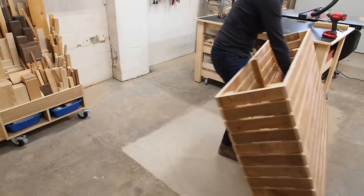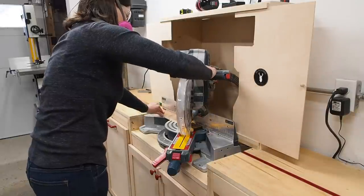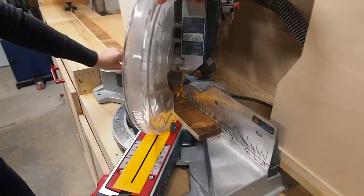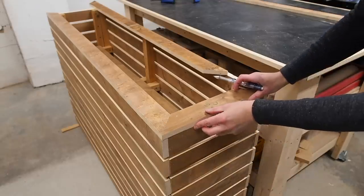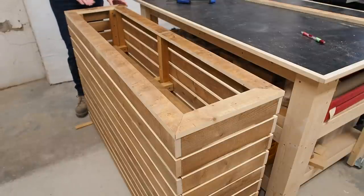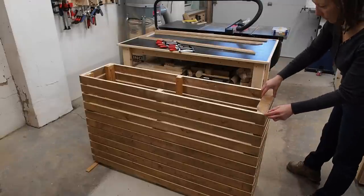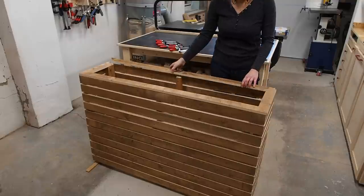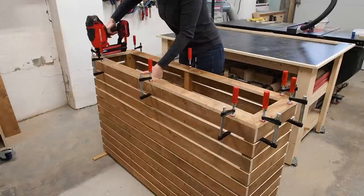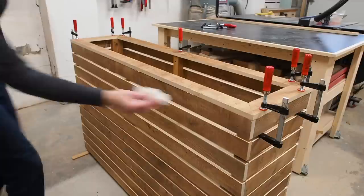Before getting to the secret door, I'm going to trim out the top. I ripped a few more fence boards into slats and I'll start by cutting one side at a 45 degree angle. I can then line it up with the corner and mark the other side, then make the cut. I'll do the same for the shorter sides, then test it out to make sure all the pieces fit just right. I've since moved on to simply using glue and brad nails to attach the trim, and it's held up well over the years. Just make sure you're using exterior type 3 waterproof glue. After dropping all the pieces into place, I like to use clamps to get the alignment just right with the miters nice and tight, then go around with a nail gun to secure the trim. Then wipe up any squeeze out with a damp towel.